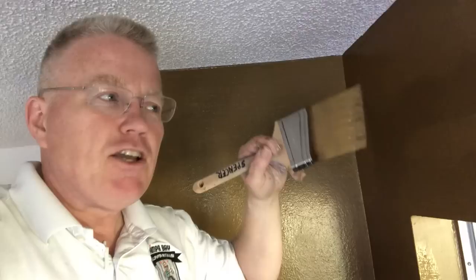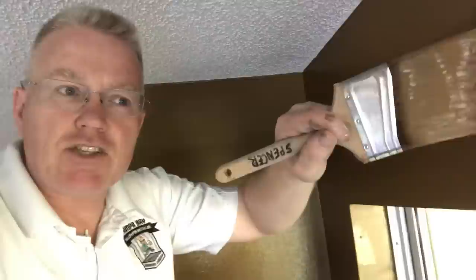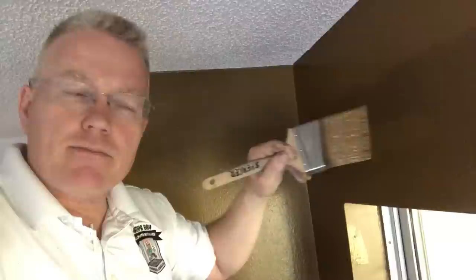This way all the paint is drying at the same time. Yes, one end will dry first when you reach the end of the wall, but it's drying in the same proportion. Every time you leave a surface for the last time with the brush, you're allowing essentially the same drying time for the next surface. You're never disturbing the paint as it's drying because you're never passing it again — going from wet toward drying, then lifting the brush like a plane taking off. Paint starts to set up after about two minutes on the wall.